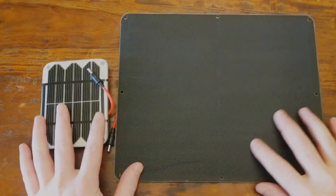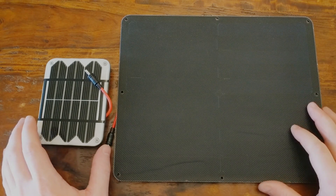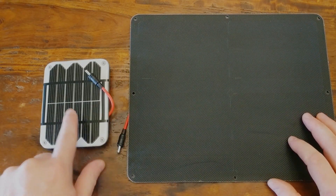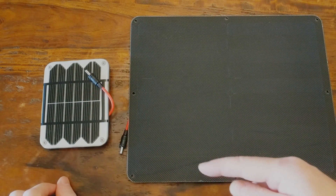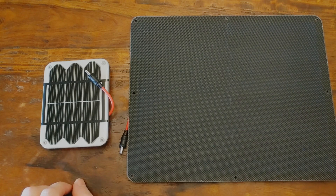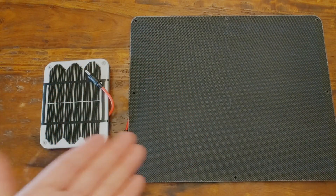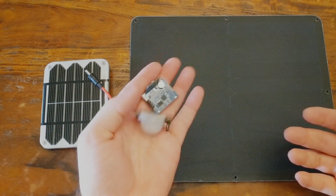As far as solar panels go, there are tons of options, but my recommendation for a good general-purpose panel is to aim for ones that output about 5 or 6 volts and at least 1 or 2 watts to charge a battery like this. This panel is 1 watt 6 volts, and this panel is 5 watts 6 volts — both from Voltaic. It really depends on how much power your IoT device consumes. I'll be using the 5-watt one, but it's overkill in this case — I could get away with the 1-watt panel. Still, with these kinds of projects, you have more flexibility if you overestimate, so if I wanted to add more peripherals, I don't feel too constrained.